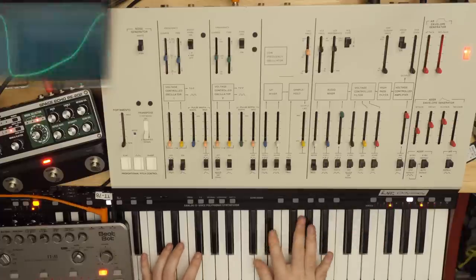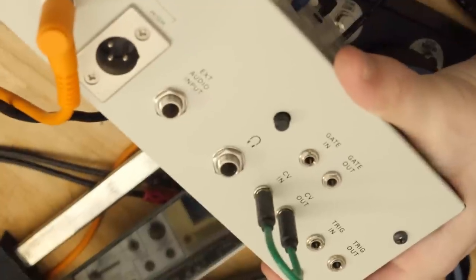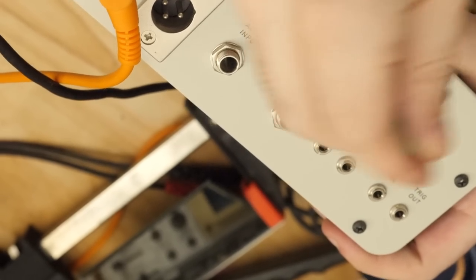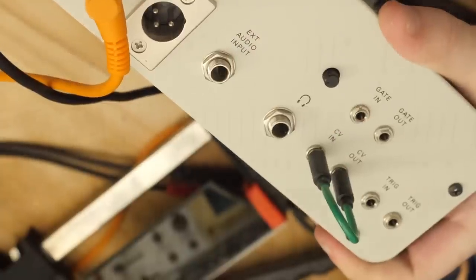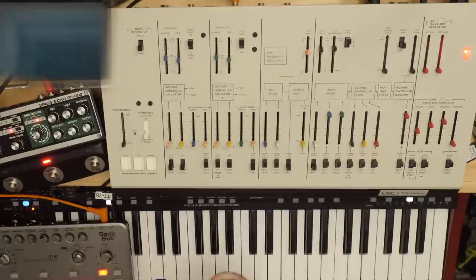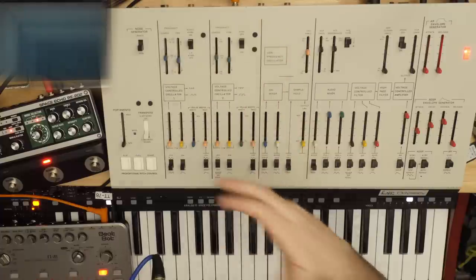So I respect that that's the way it used to work, but that's not the way modern synthesizers work. We have options to get around that. In the patch bay on the back, I have really tiny cables that work great for it, but if you patch the CV out to the CV in, you can defeat that duophony, but then you're always low note priority. It's nice to have some consistency in that behavior and not accidentally play two notes at the same time, which definitely happens. But you hear what I'm saying. I just wish that was one of those things that became a modern convenience. How hard would it have been to implement that into this circuit? I'm not an expert, but I don't think it would have been that bad. And would I have been pissed off about a few switches on the back? No, I wouldn't have been.